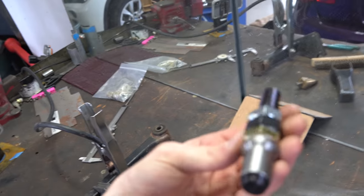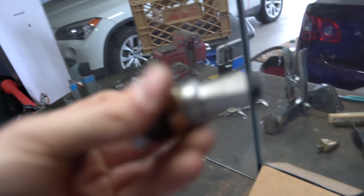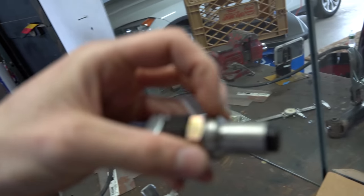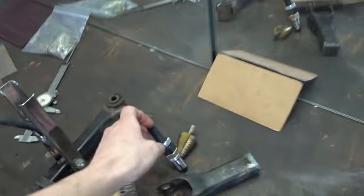Just like that - we are done welding this one little section. We're going to drill these holes out right in the center of both of these. We're going to take this step bit, throw this bung in there - there's this little recess on here. We're going to drill it out so the hole's big enough, and then we'll be able to weld right between inside of here in this little burr. I'm excited, so let's get this all welded up.